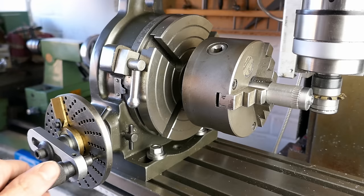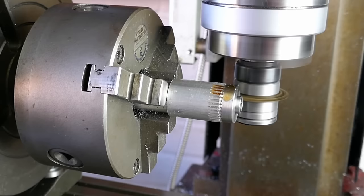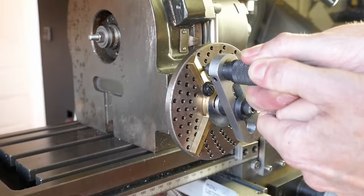The next gear is 34 teeth, and I can't achieve 34 divisions with any combination of the change wheels I have available. I'm going to have to use the rotary table with the division plates. My rotary table has a 90-to-1 gear ratio, so I need the 17-hole dividing plate, incrementing 45 holes for each division.